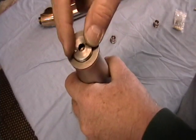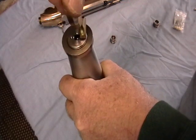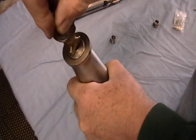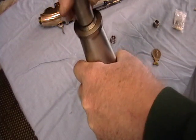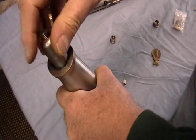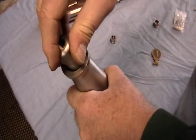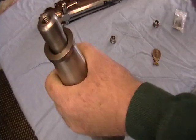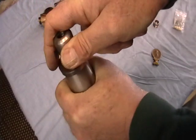This is about a 300 thousandths orifice. The other was about a 270. And this one's a little easier to use. And then I have one that's a 320. Gives me a lot of power, but only about 10 good shots. This one will give me about 20 shots, averaging over 100 foot-pounds. If I want to torque this down a little more, I have a hole in the side, and I can give it a little. It doesn't need a lot because it is an O-ring.